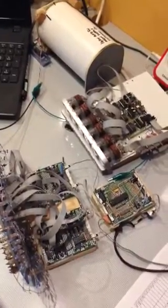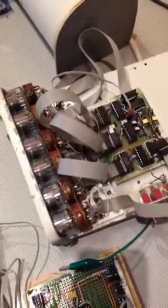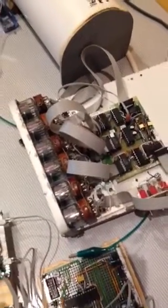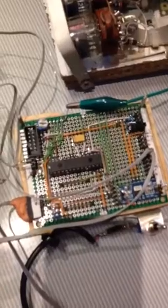Next to that you can see the Nixie driver board, which I'll come to in a moment. This is the main processor board, which is a Micromite system. You can see the Micromite chip there. I'll describe this in more detail when it's more or less populated, but it'll have various real-time clock boards and temperature, humidity sensors and so forth on it eventually.